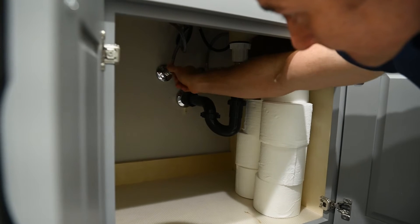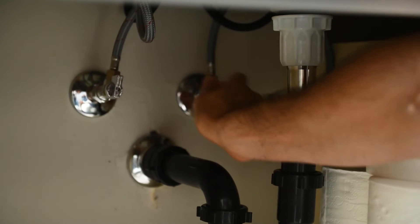Next, you're going to want to check for leaks in your home — traveling around and checking underneath your sinks. I recommend on an annual basis turning all the valves, because in Arizona's high-calcium water it's not uncommon for valves to freeze. For every sink, toilet, and washing machine, go and turn those valves off and then back on to make sure they're not freezing in place. Then check for leaks while you're there, making sure there's no drip or moisture — that's going to save you from mold and long-term water damage.